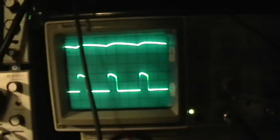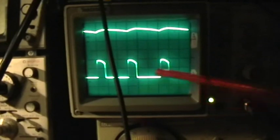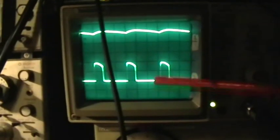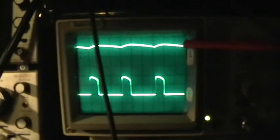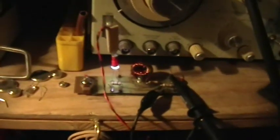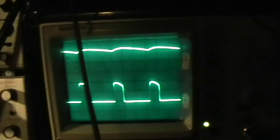This is part two. What I've got now is the phototransistor output shown on trace two, which reflects the actual light coming out of the LED on the board. And this then is the battery trace — the input battery voltage measured at the normal ordinary points that we have been using for measuring this board.